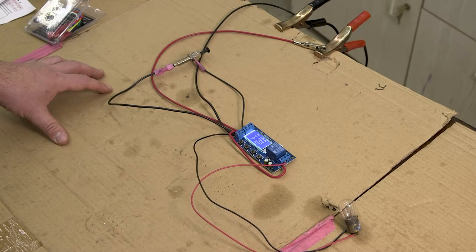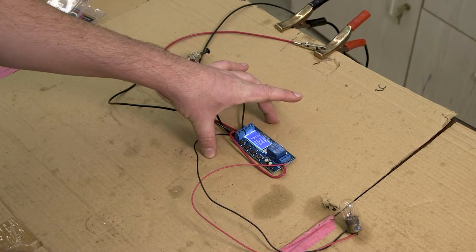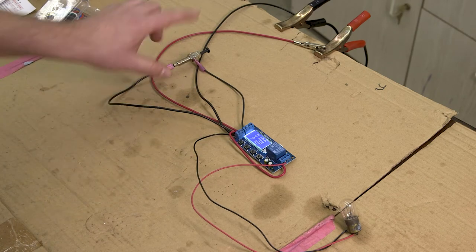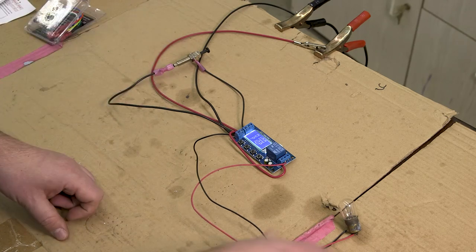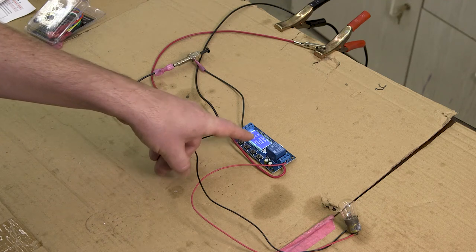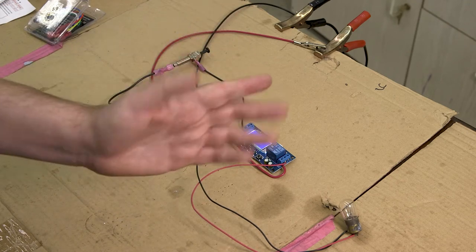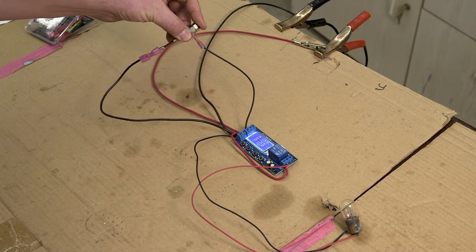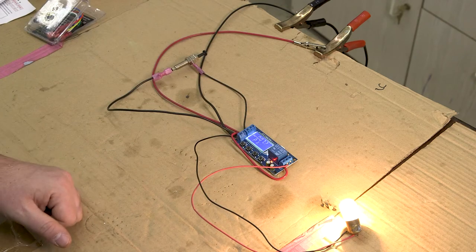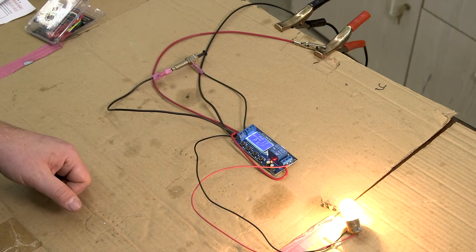Here is a very basic circuit setup. I have power being supplied from my battery charger, a time delay relay circuit, and in this particular case it's a very complicated programmable unit that has an output screen so we can see the settings. I have a switch to simulate a door switch and a light bulb to simulate an output device. On the screen you can see it's configured for 10 seconds, and the P1 OP setting means it's set to instantly on, delayed off. So when the door opens it instantly engages the relay and turns on the light, and after the 10-second period — whether the door is open or closed — the circuit shuts itself back off.